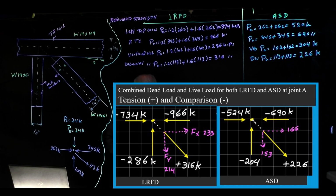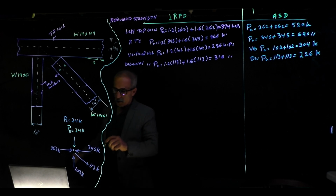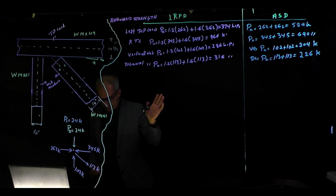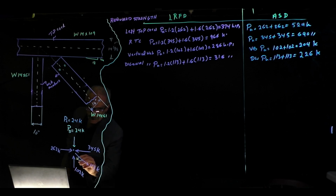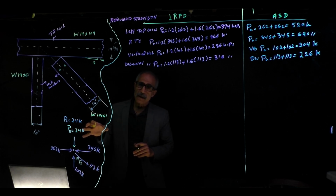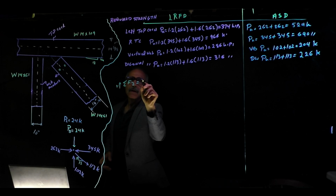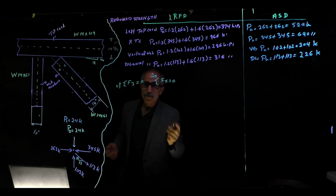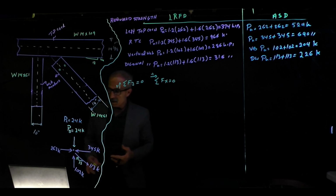Now let's do some structural analysis. Because remember in kindergarten, when you took structural analysis, we look at the member here. If I look at this one right here, that'd be 11 and 12. Because this is a pin, summation Fy should come out equal to 0, and summation Fx should become 0. Remember those days? Those two should come out 0. So we can look at this and do a structural analysis, to see if this is really going to work out. We have all the numbers.